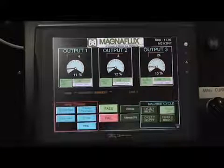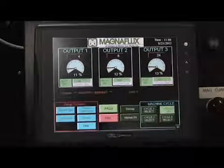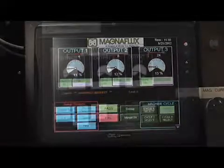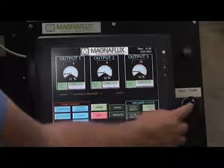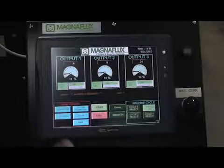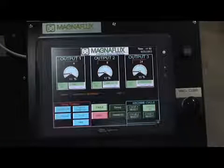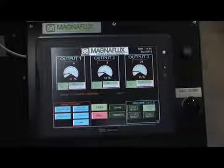Once the cycle is chosen and the part is set up to be magnetized, the operator would push the Mag button, which is located to the right of the touch screen, but still on the remote pedestal mount. If the cycle mode is not chosen, the operator can push the Mag button whenever the part is ready to be magnetized, and it would perform one magnetizing shot based on either the manual or recipe settings.